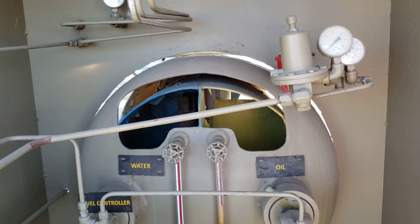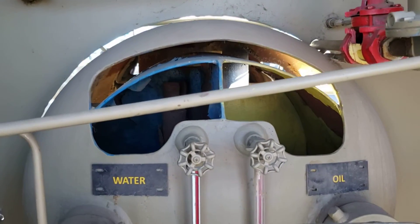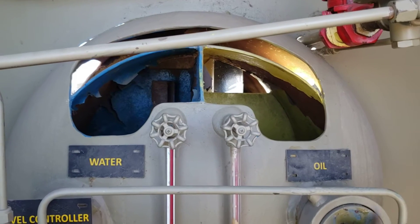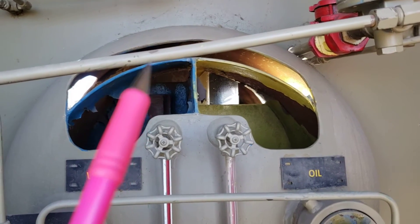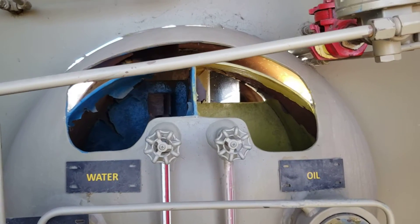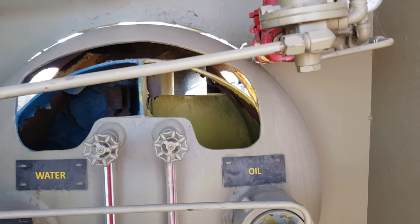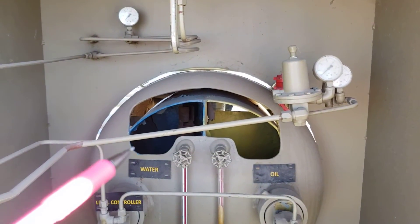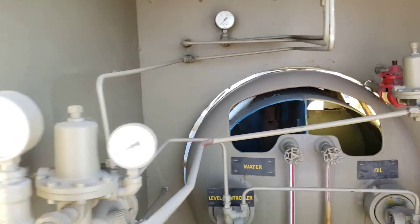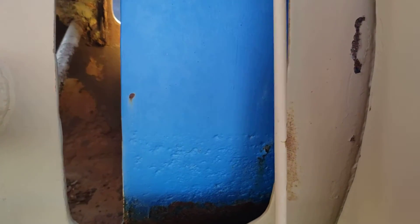You can see they've cut the heads out and the weir boxes so you can see the water and the oil side weir walls. You can look in there and see the different heights. The water weir box works by a pipe on the inside letting water in from below and draining it out — that's why it's got a much higher weir wall than the oil side. That way you can skim the oil off the top of the water and drain the water off the bottom of the oil. That pipe is connected on the inside to the bottom of the weir box.